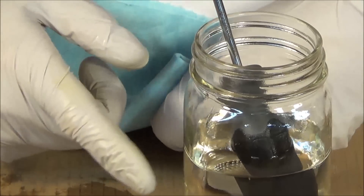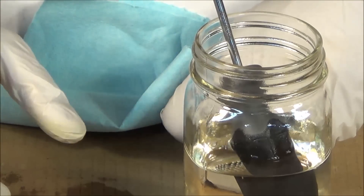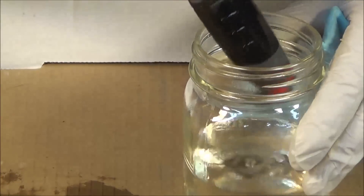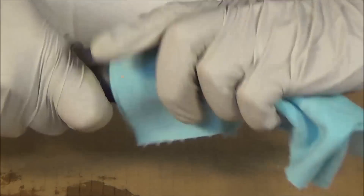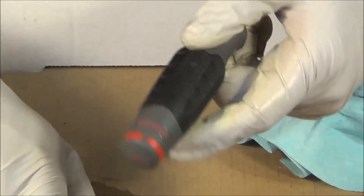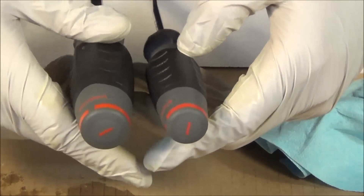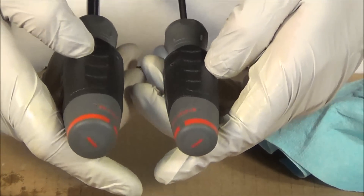Our final test is going to be the acetone. This is the most corrosive of all the chemicals here, even including the gasoline. If anything was going to cause a problem with these handles, it's going to be the acetone. We'll go ahead and pop this out, dry it off, and compare it to our control. This sat in it for over 24 hours, and it's going to be amazing if this does not have any separation or damage. Looking at the two side by side: there is absolutely no swelling, no separation between the layers, and no discoloration.